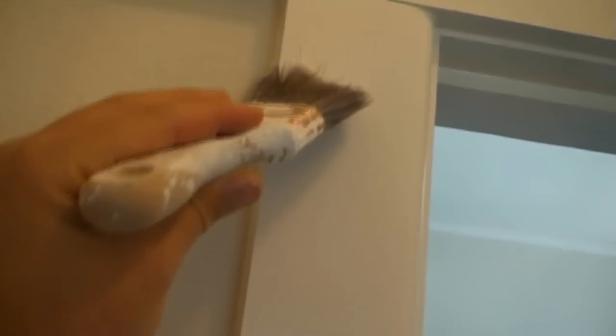Okay, so you cut in here, bring it around, over here, wipe it off if you want, and then your last motion, back brush it from the new paint towards the old, right? Then you go again, about 20 centimeters, cut in, bring it down, bring it around. If you want, wipe this face off, and then back brush it from the new paint towards the old, yeah? And that's how you go all the way down. So that way you can keep a wet edge and just leave this broad face, the middle section, unpainted.